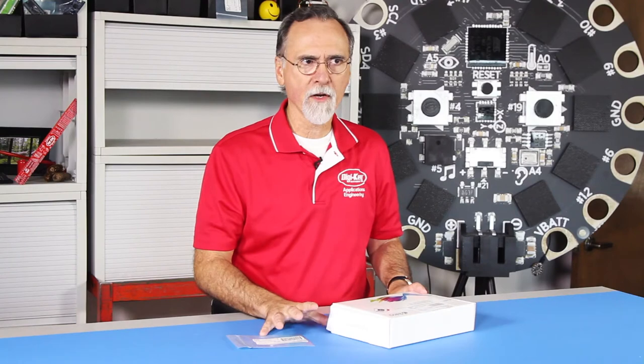Today there's a whole lot of talk with IoT and a lot of activity around RF, so I've brought some RF products. What's very hot right now is Bluetooth connected devices, and version 5 of the standard has been out for a while. What version 5 does is it increases the data rate twice as fast over Bluetooth version 4.2, but it also has a longer range.